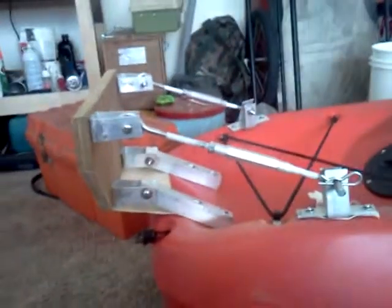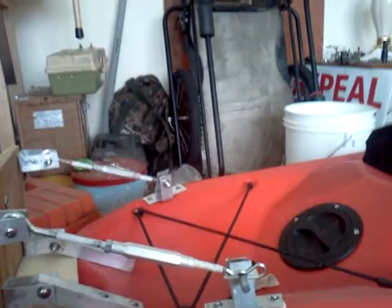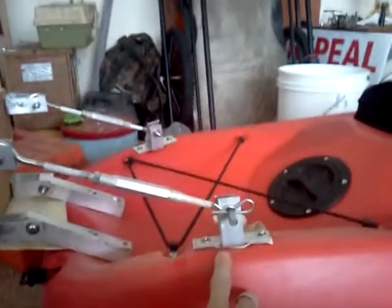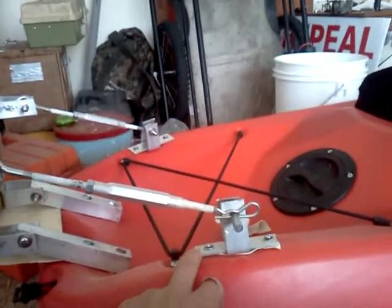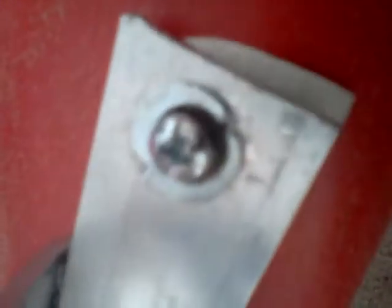What I did was I put the motor on the lowest setting. I moved the brace bars here — this one on the right to the middle instead of in the back. I also put the support plate on the top instead of on the bottom, so that brings it so it doesn't move so readily back and forth. That will reduce the amount of stress put on that center bolt by actually utilizing all three bolts.